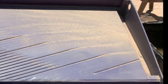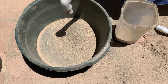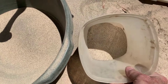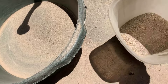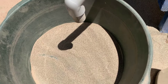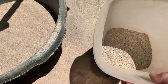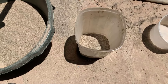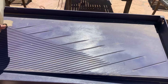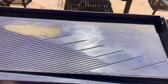That's five and a half Hertz and seventy-five percent amplitude. With that entirely makeshift system, there's the cons — of course not very concentrated — and there's the tailings, which still show some black sand but not as much. So it sort of worked. Now it's just a matter of improving it: six Hertz, seventy-five percent, minus one degree horizontal, fourteen and a half degrees vertical.